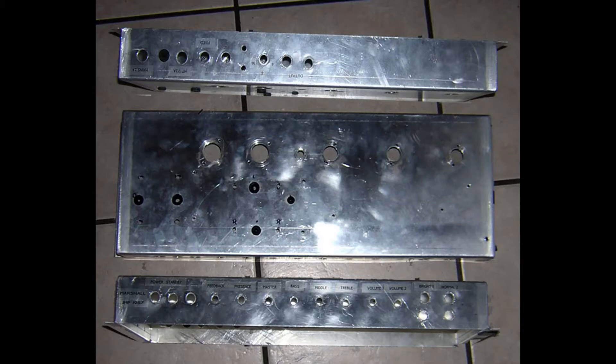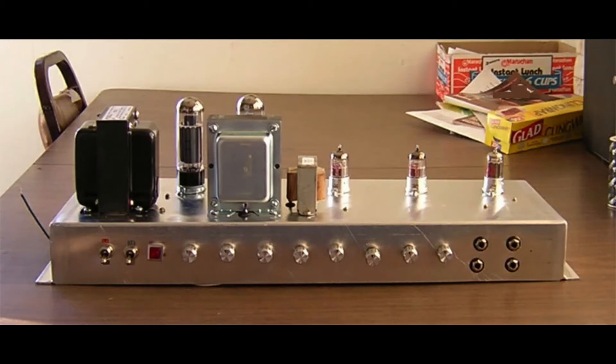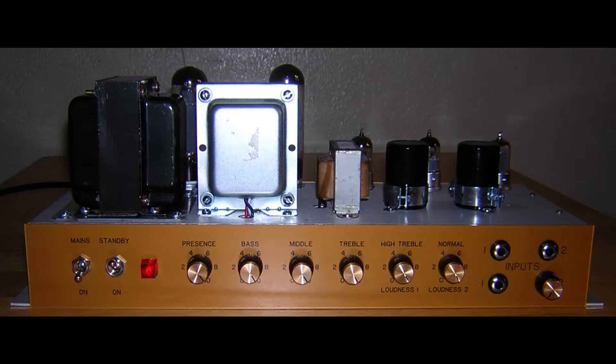It started with a blank chassis that I had custom made, which I punched and drilled myself. The amp had several tweakable features including a pentode/triode switch, fixed cathode bias switch, a switched and variable negative feedback, and bias test points that read plate current through one tube for gathering data — used in a 22-page report at the end of the class. I eventually decided to transplant the amp's guts into a better chassis and purchased a Mojotone chassis and faceplate set, selling the old chassis on the classified section of a vintage guitar amp forum.